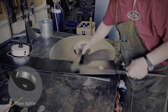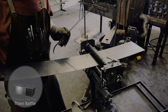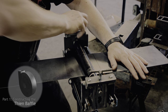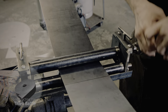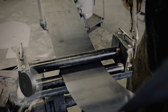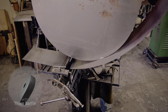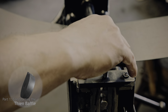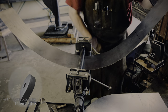With this brilliant realization in mind, I proceeded to make myself a Frankenstein pyramid roller. It consists of 3 rolls where one sits on top and can be moved down to increase the bending amount. Ideally, I would have used a lathe and solid rolls, but that was not an option in this case. Instead, I welded something together from black plumbing pipe. Nonetheless, it seems to get the job done and my vice grips constitute an almost perfect crank. I occasionally check how close I have come to the right radius, but in the end managed to slightly overbend the sheet metal anyway. It turned out that was not really a problem and the jig I built for clamping took care of removing gaps in the joint.